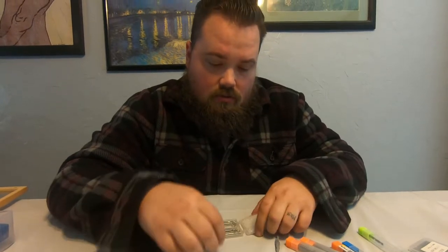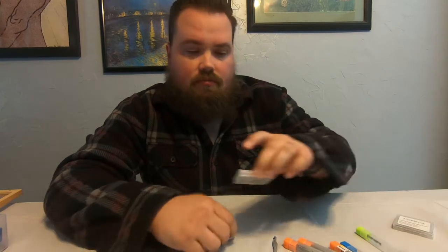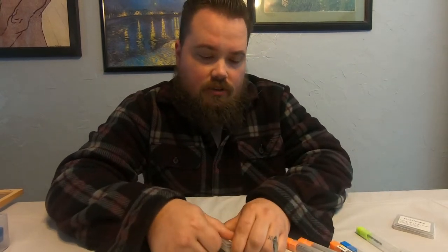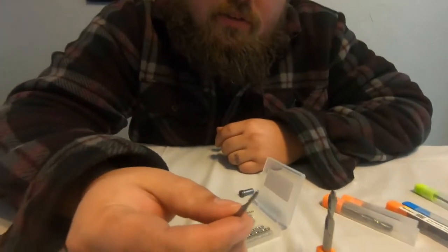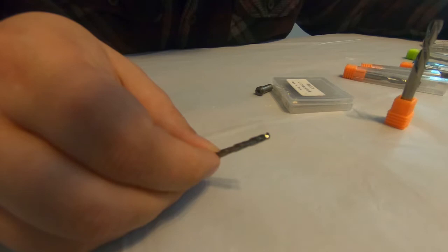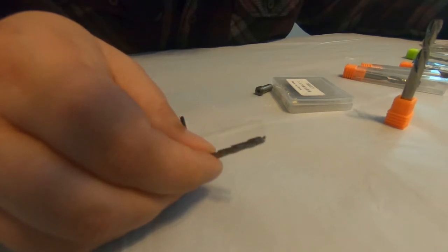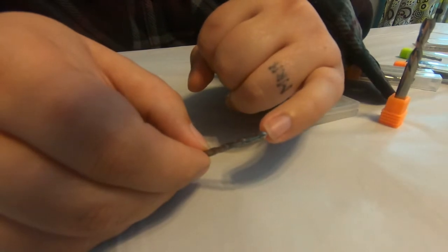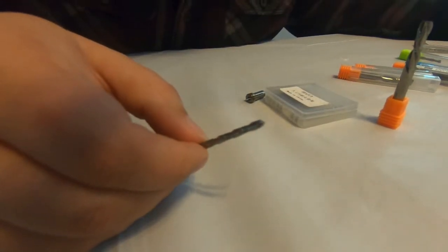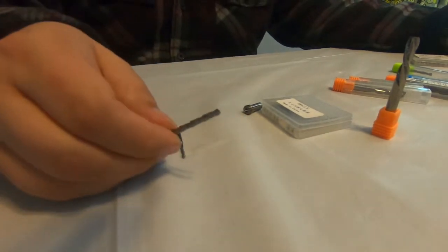Now these are the main two bits I used for quite a long time. Then we can get into more specialty bits. If you're wanting to do any kind of true 3D cutting, this is a bullnose bit. The end has a radius across it and you only want to cut with the very tip of it. These tool paths take a very long time because you're cutting with such a small space, but this is how you do true 3D cuts with curves in your designs.